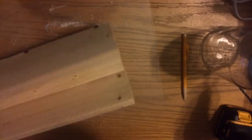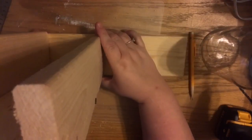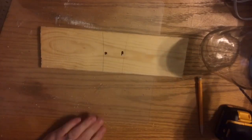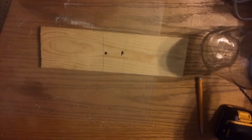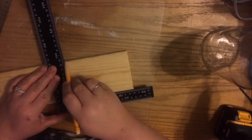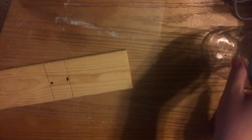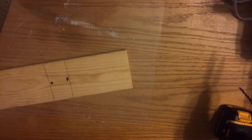Now I think I finally have it straightened out. I'm taking the board that was going to be used for the sides and I'm measuring the width of the box, marking which width goes to which side of the box. I've marked it with A and B, and now I'm making the line straight because the boards were warped — the lines wanted to be warped as well, so I went ahead and straightened them out by the widest point.